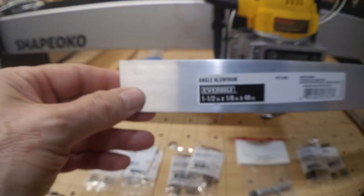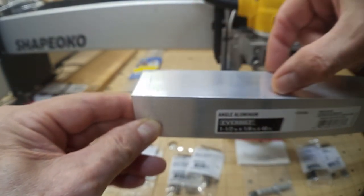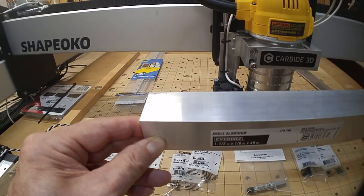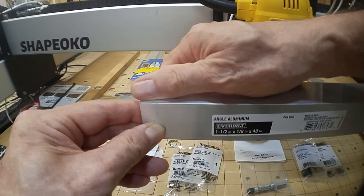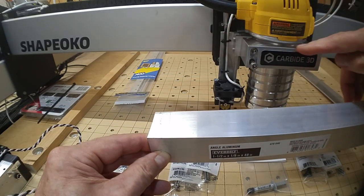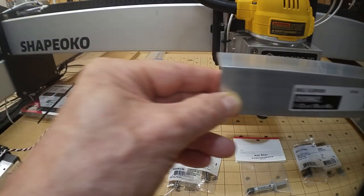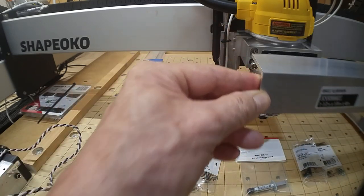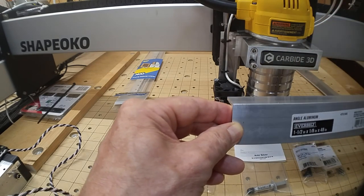The plan is to cut a good chunk off the top — matching the width of the spindle mount — and leave a little lip at the top that will rest along the edge of the spindle mount to keep it from tilting. Then bore two holes and go with longer screws, so this just butts up against the mount and rests on top.